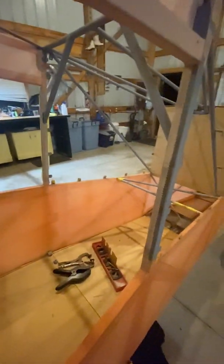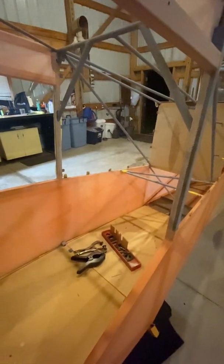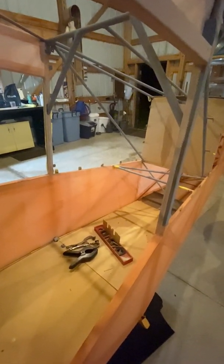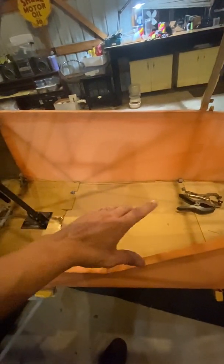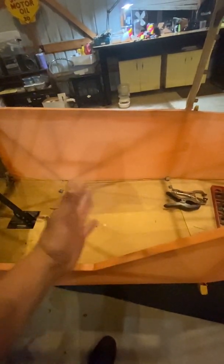Standard N3 Pup has a bar that goes from here to here. I've done the modifications times 10 that you would do for the 2-seat version. I got a Cessna Skymaster seat. I got 6 of them actually, somebody gave me. So I'm going to put a Skymaster seat and Cessna seat rails in here so that I can move the seat back and forward.